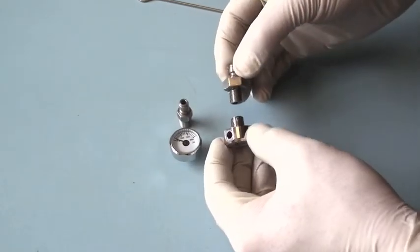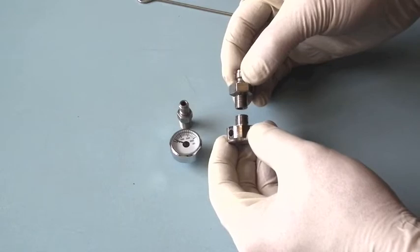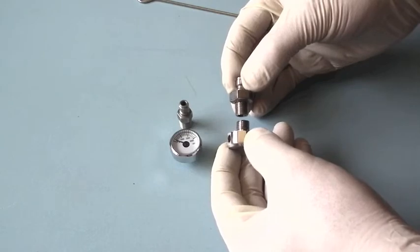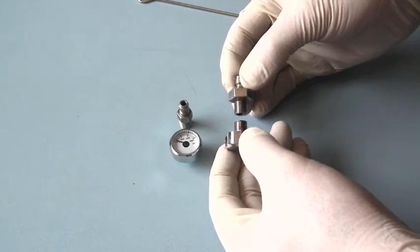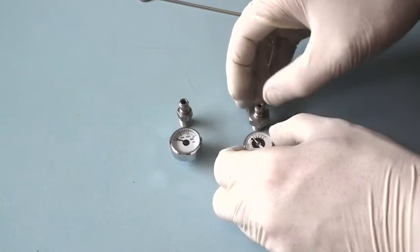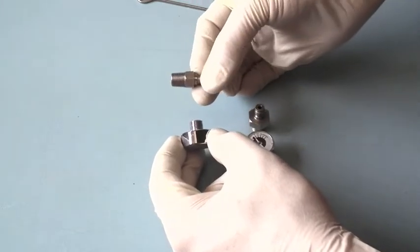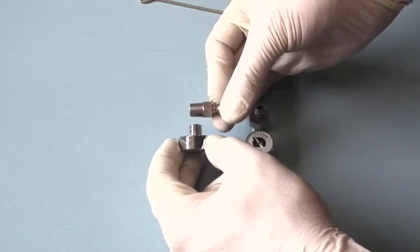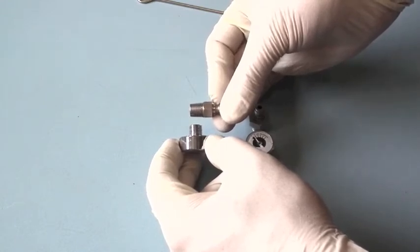Here we have two gauges and two inlet valve Foster nipples. In the UK, the most common thread size is 1/8 BSP, which means one-eighth of an inch internal bore British Standard Pipe. You can also get BSP-T, which means British Standard Pipe Tapered — this is more like what you'll find on guns from the Far East and in America. This thread is 1/8 BSP-T, also known as 1/8 NPT. There is a very small difference, but in general you can interchange an 1/8 NPT with a 1/8 BSP-T and vice versa.